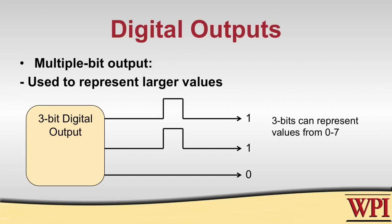The simplest of digital sensors is nothing more than, for example, a simple push-button switch. The switch in one position outputs one value, let's say a 0, and in the other position it outputs a 1. Analog sensors generally output a continuous signal, usually a voltage, which is proportional to what's being measured.